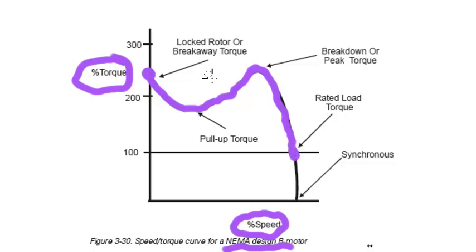So the four-bolt design on each foot is engineered to overcome or meet the requirements of the breakdown or peak torque, and not the running torque. So I would think it would be safe to loosen one bolt. In fact, I know it's safe — I've done it many times while it's running, because the torque is much lower than during startup.